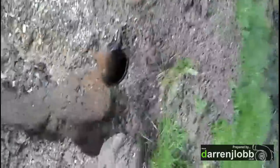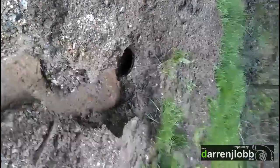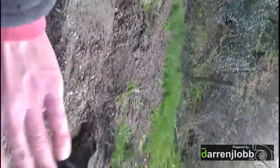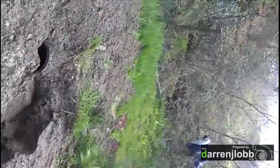Excuse the quality — we're running on a phone camera now because I didn't bring anything with me. But due to excessive rain this winter we've got several farm bridges like this one, which basically crosses over a river to give us access to other fields. It basically silted up — leaves and wood went up against the pipes we had put in, blocked it up, and then it just silted the catchment area right up and overflowed over the bridge.